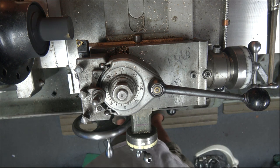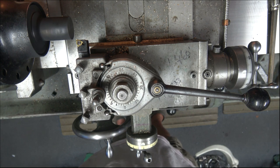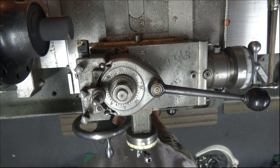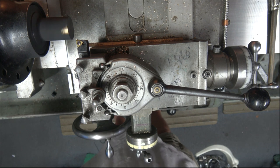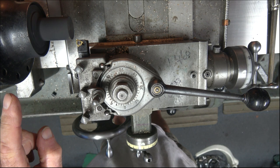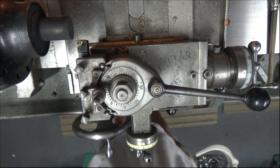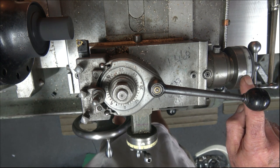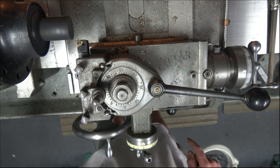As I say, just to remind you, the lathe is set for 4 TPI, we're doing a 4-start thread. You've got to remember the depth of cut of the screw, because it's going to turn out as 16 TPI, you only need to set this thread depth for 16 TPI. And in this instance, it happens to be 40 thou. So what I intend to do is 3 cuts of 10 thou, 2 cuts of 5 thou, and 2 spring cuts. So here we go, and by the way, this is brass. I've just blacked it, so we can actually see the thread. So let's say I'll set the compound to zero, and let's see what sort of mess I can make of this.